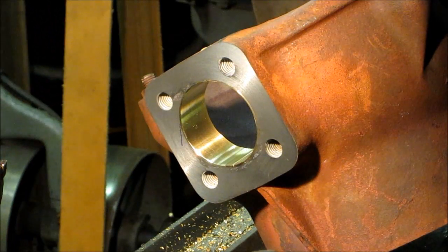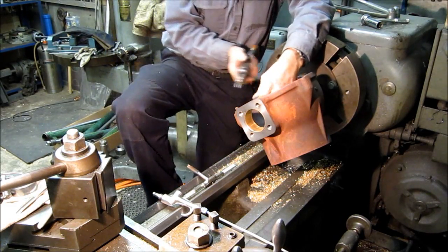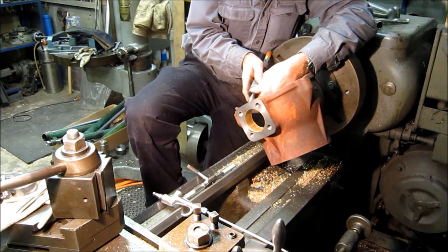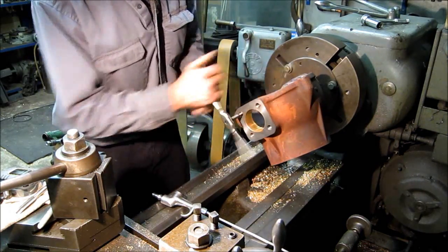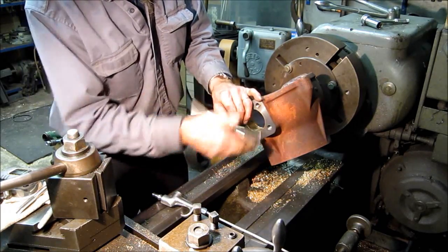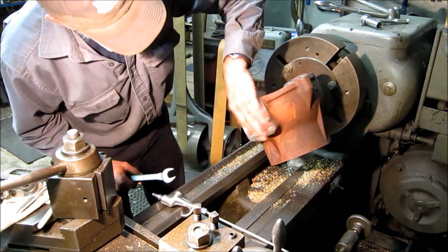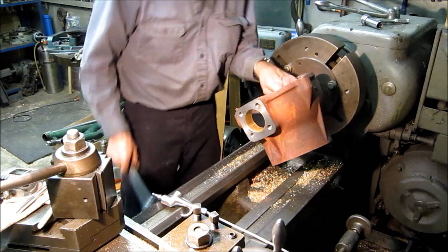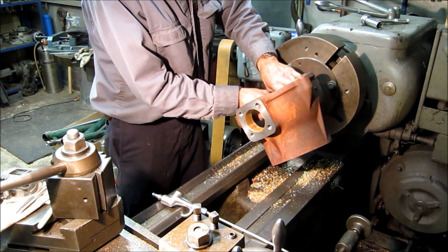Within a couple tenths. We're just clearing out this side of the brass built up into the tap holes and running the tap through — just the last one. Now that we've tapped out the holes we can take it out. It was a good thing we put it back in here because that gave us a good hold-down on the thing to work.